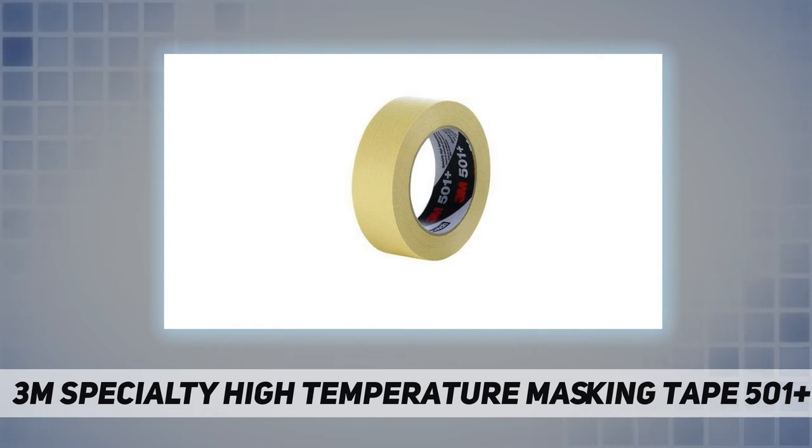A special back size treatment provides a smooth unwind for easy handling, control, and reduced waste. It is easy to tear from the roll, which aids in handling, yet strong enough to resist unwanted tearing when removing after the job is done. 3M High Temperature Masking Tape 501 Plus is conformable for easy masking around corners and over irregular surfaces, and offers easy handling that reduces application time. This tape can be qualified for ASTM D6123, replaces obsolete PPP-T-42C Type 1 and CID A-A-883B. Adhesion to steel: 36 oz/in width. Tensile strength: 26 lbs/in width, 455 N/100mm. Elongation at break: 10%. Tape thickness: 7.30 mils (0.20 mm). Temperature use range: up to 300°F (149°C) for 30 minutes.